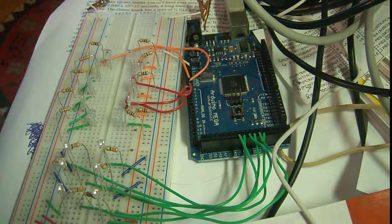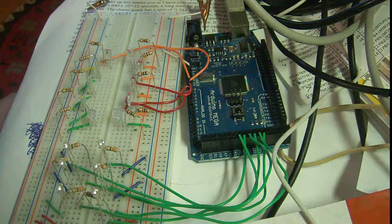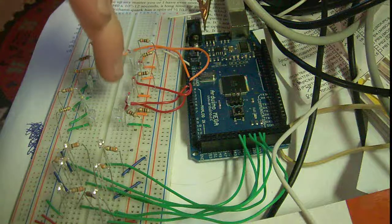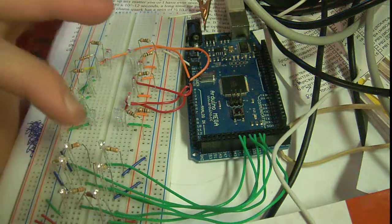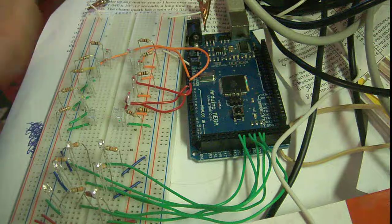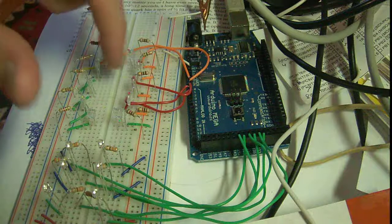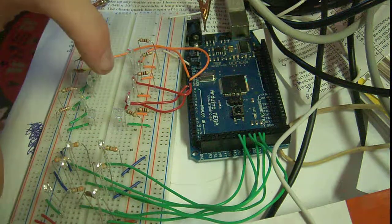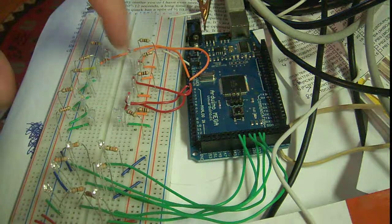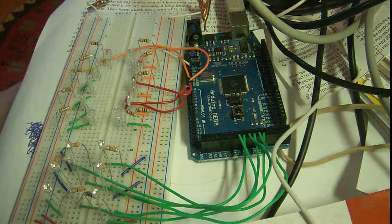What the code does is it first sees which of the columns is being pushed. Obviously, if nothing's being pushed, nothing happens. And then if it's the top column, it sees if it's the middle, left, or right. I have a little matrix of two by three LEDs. And then if you were to touch the top left on this one, the middle bottom on this one would light up. So the code just sees which beam is being broken, and when one horizontal is broken, it sees which of the three vertical beams is broken. It's very simple.